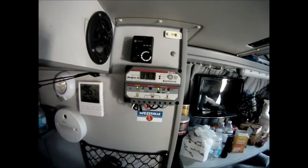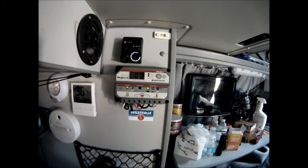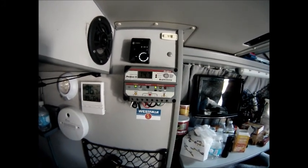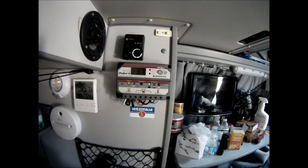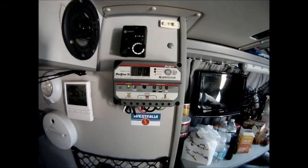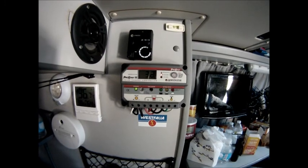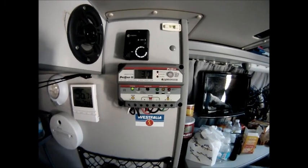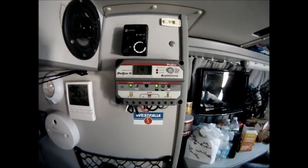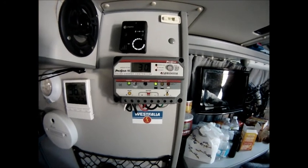Alright, so I have both panels connected and we've got 3.2 solar amps, which is a boost of about an amp and a half — a little more than an amp and a half. The blinking light on the charge controller is showing that it is charging. My voltage is at 14.7. Finally a nice sunny day, able to show its potential with the 100 watt panel connected to the system.